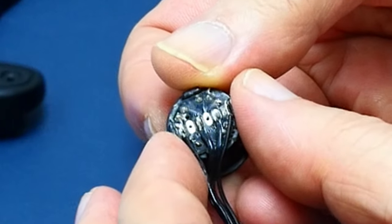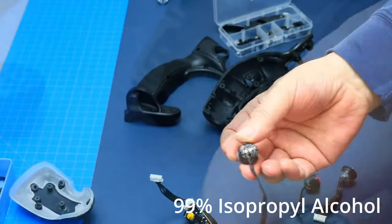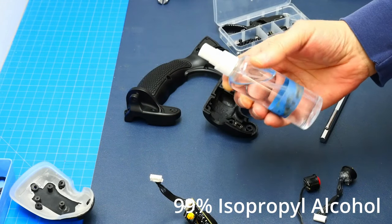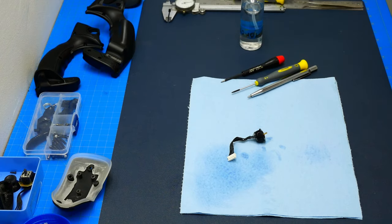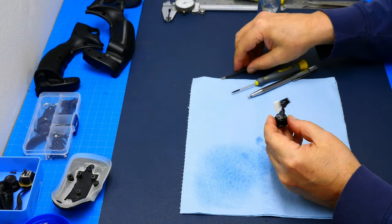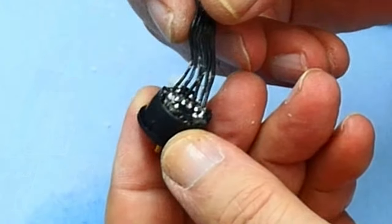All cleaned up. The best way to clean those buttons up is to remove the bigger part of the hot glue and then use alcohol. I have distilled alcohol in a little spray bottle - I just soak the button in there until that glue softens up, and then you can remove it and scrape off the rest if needed. Soaking with alcohol is a big help, especially around the edges. It doesn't hurt electronics - that's just the way I do it.